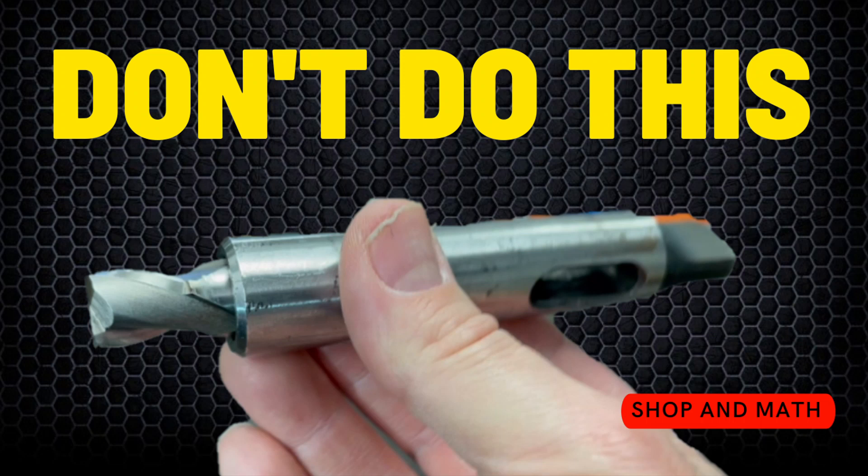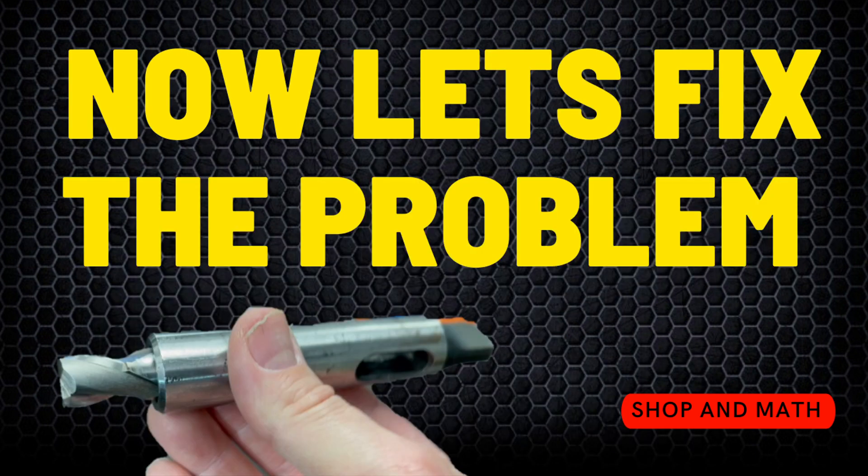Don't do this. If you're in a machine shop environment you will know exactly what I'm talking about. You don't put an end mill inside of a Morse taper unless the end mill has a Morse taper on it. An unnamed student actually did this — he put an end mill inside of a Morse taper adapter and put it into the tailstock of a lathe and semi-successfully cut his workpiece.